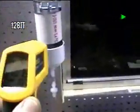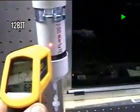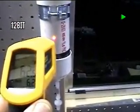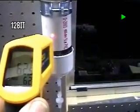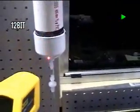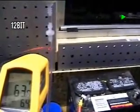Let's go to the bubbler and hit it and see if we can get a temperature off of it. And here we are — the bubbler is only at 62 degrees. So the gas does cool off, and of course the gas is dry because, as you can see, there isn't any condensate in the lines at all. You can actually see the little red infrared light there, and that hose going in is at 64 degrees.